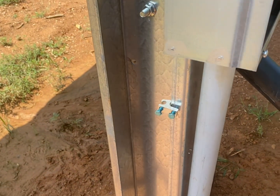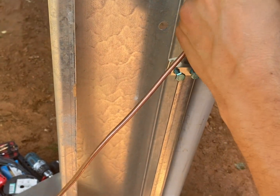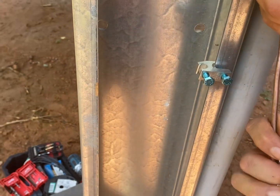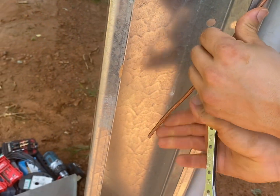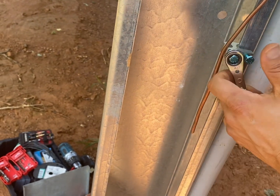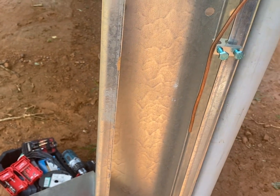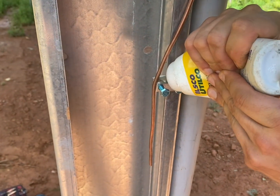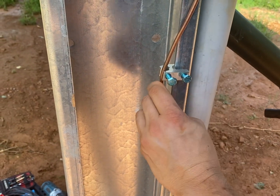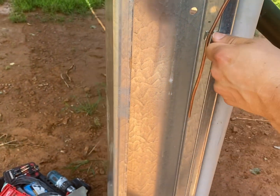Take a little bit of ground wire — this is a piece of four, but you can use a piece of six. This is called bare wire, and if you use a piece of six it's a lot easier to work with than a piece of four. I'm just weaving it in here. They don't want you to run smaller than number six where it's exposed and subject to damage — the code does not allow something smaller than that.